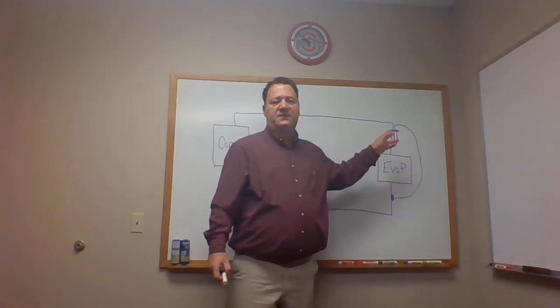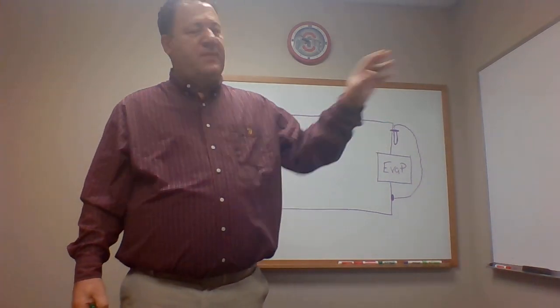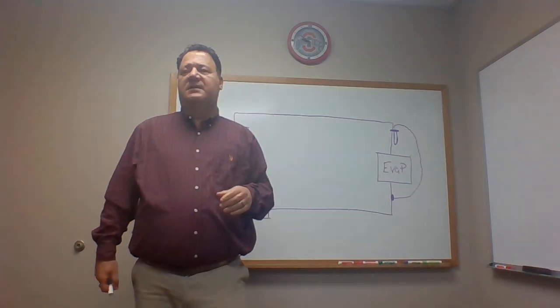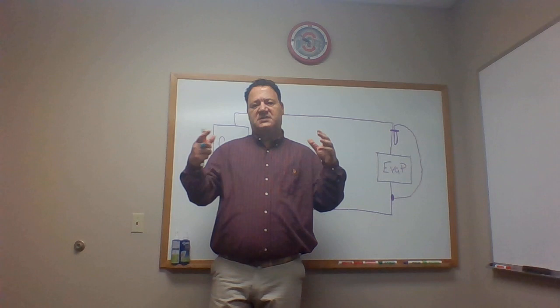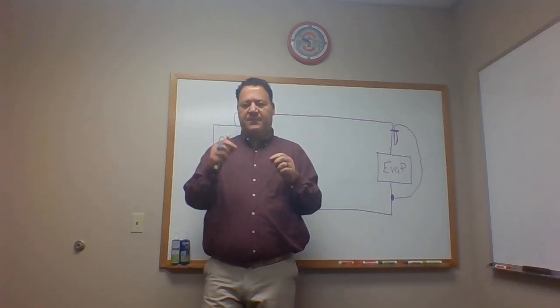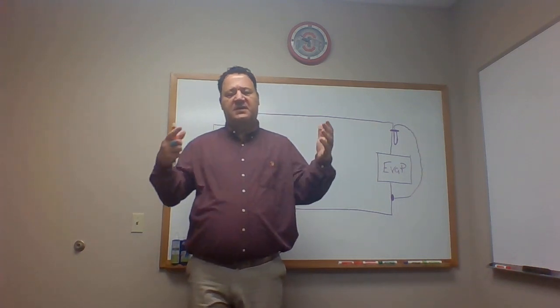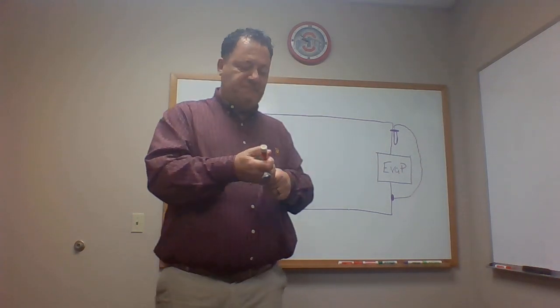I want you to think of that metering device as almost like a Windex bottle. We're squeezing that trigger. It's atomized, so it's primarily liquid at the beginning. For the sake of not arguing, let's just say it's 75% liquid, 85% liquid, and the rest of it's vapor. Anytime you have any combination of liquid and vapor within each other, you have saturation. It could be one droplet of liquid, the rest vapor, you have saturation, okay? And we need saturation, right?